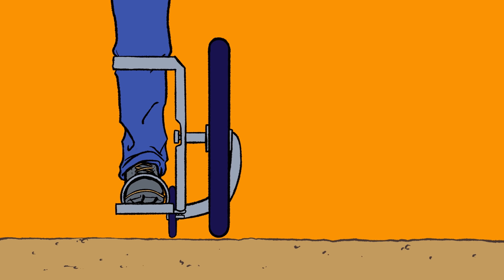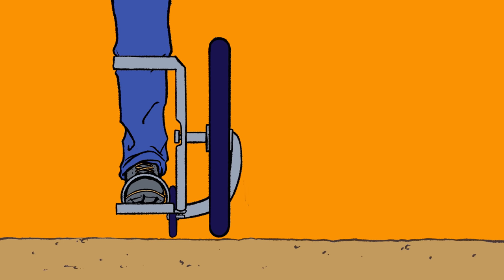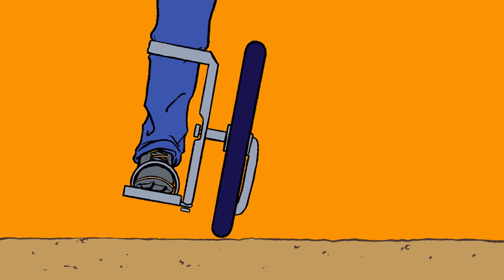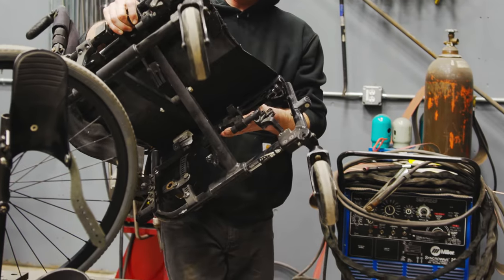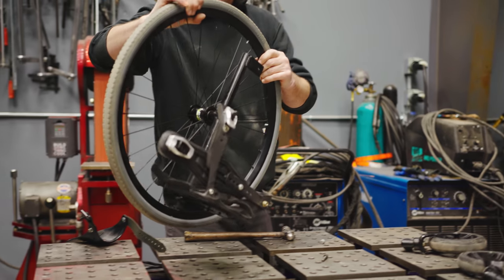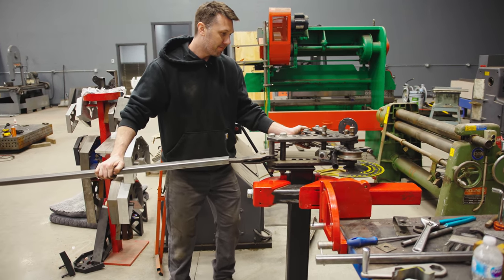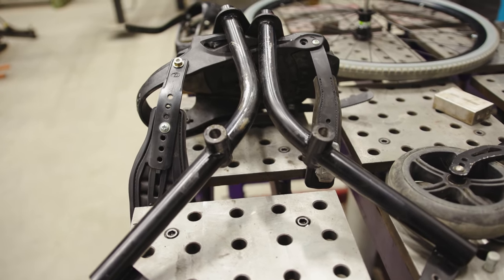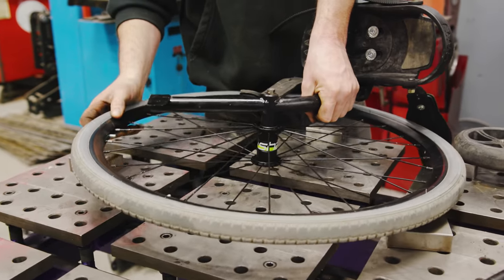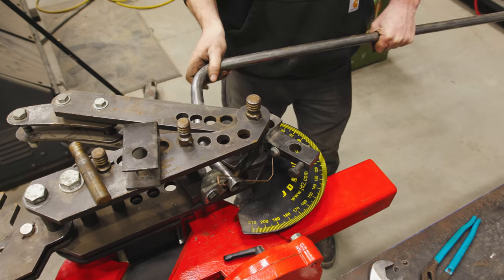I also thought about positioning the training wheel off to the side — it would help with stability and take some load off my ankles, but if you try to lean in the opposite direction that wheel's going to come off the ground. I'd like these skates to behave more like a set of rollerblades than a child's bicycle, so I'm going to place the rear wheel in line with the big one. For the training wheel I'm going to use the front wheels from the wheelchair — about the perfect size. To address the center of gravity issue, I'm putting a bend in the mainframe with the JD2 squared tubing bender to position my weight between the two wheels. Now I can bend up a control arm where the training wheel is going to live, but first I've got to build a hub to mount the wheel to the trailing arm.